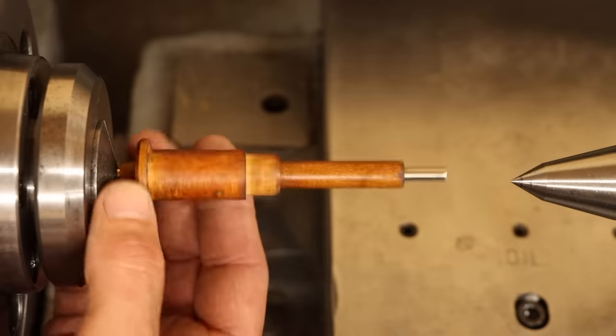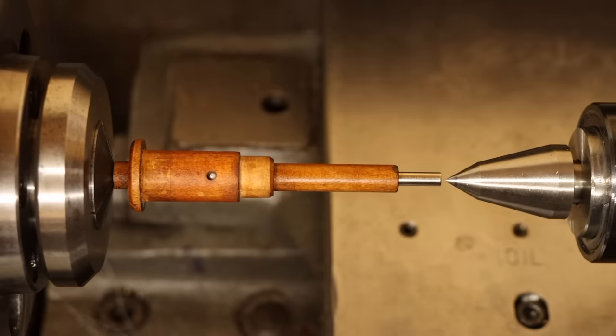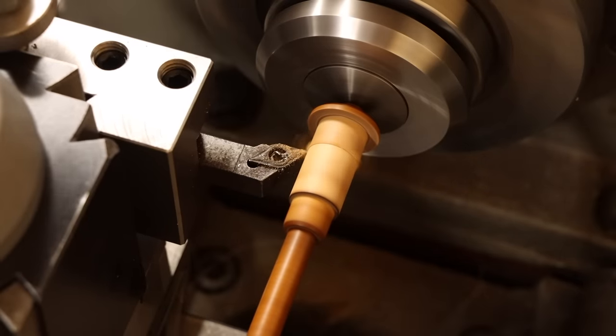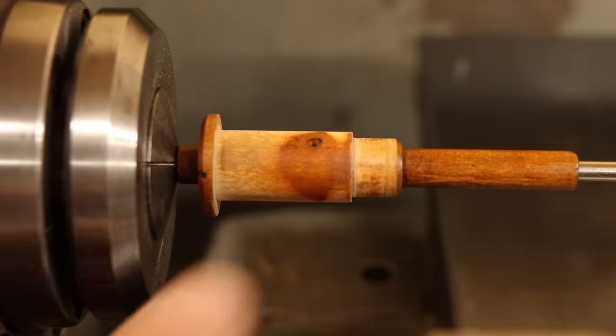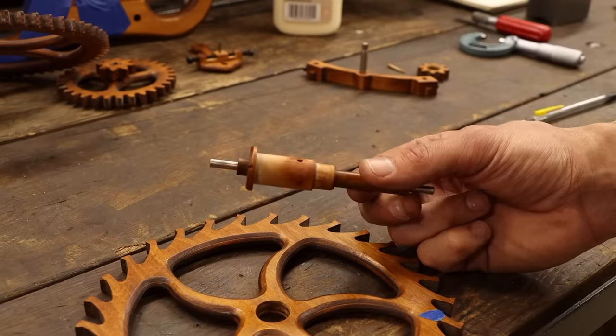Perfect — let's get this on the lathe. I've never turned wood before, and a smart person would probably do some testing on a scrap piece, but only future Brandon seems to have considered this risk. Fortunately it goes without a hitch. I've turned down the diameter just enough to clear the apparent runout where the wheel mounts — that's one variable of the equation sorted out.